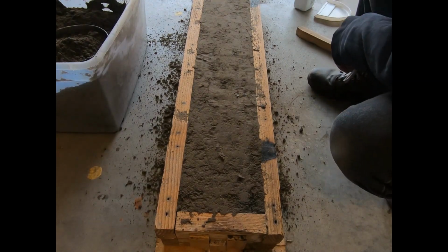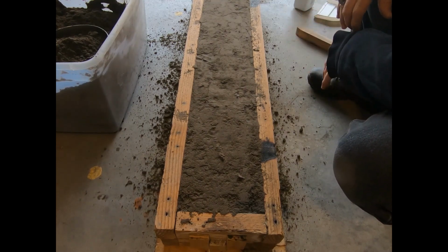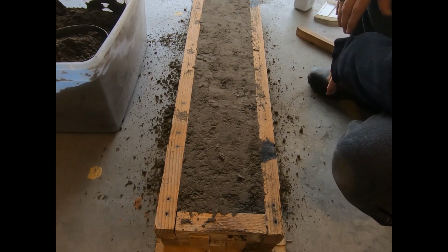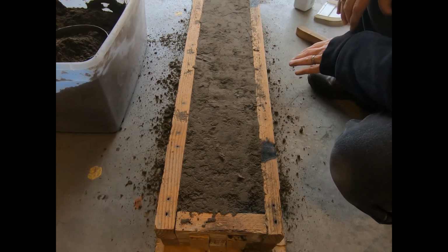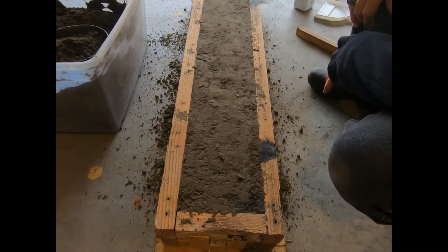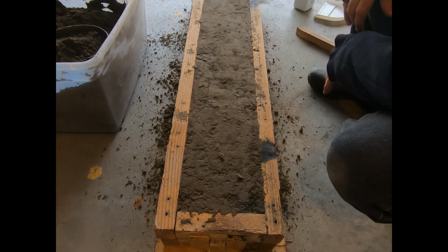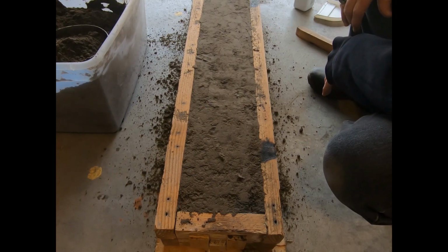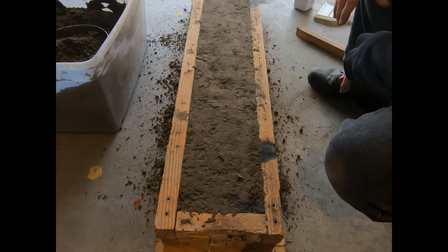All right, that second half is all rammed up. Unlike Scopedia, I am significantly more confident in this turning out than I was with that second attempt with a sword, because what I just packed in sand is flat, whereas Scopedia was not flat. It didn't have any flat surfaces. And it was not 3D printed the way you often see swords 3D printed and then cast, where they actually have two flat sides. You lay one flat side down, just like you do with a number of objects.